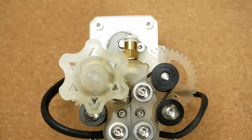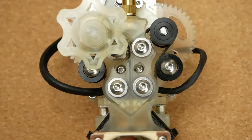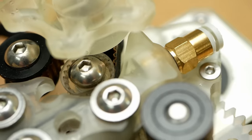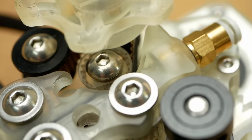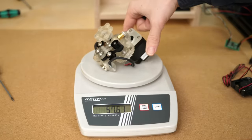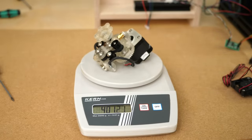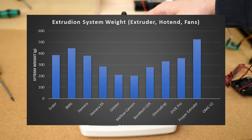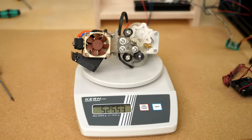This not only doesn't damage the material but also allows the printing of very flexible filaments. The whole body is SLA-printed from resin, giving it this unique transparent look. As cool as it looks, this extruder is heavy, weighing in at 401g, and a whopping 526g if you include a hotend and cooling solution.